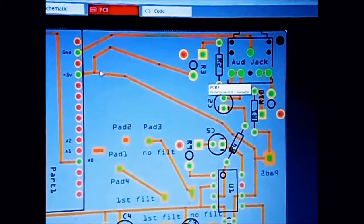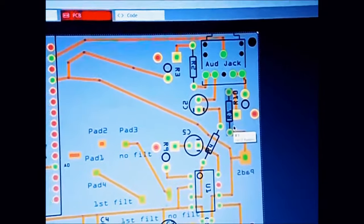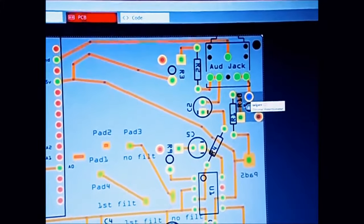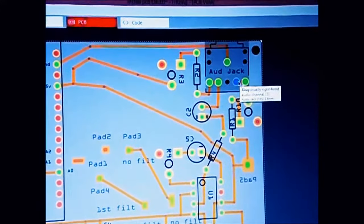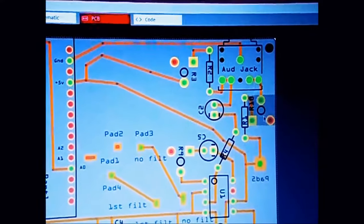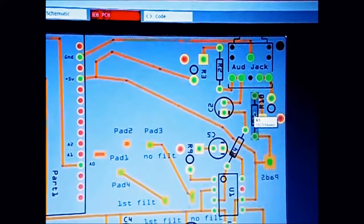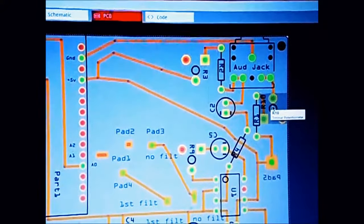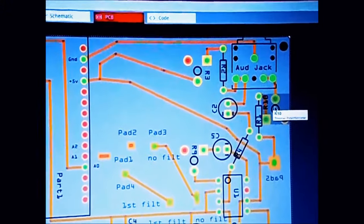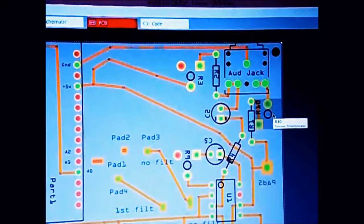So we go now on 5 volts again, goes here under this resistor, and it goes back onto a 150 ohm resistor, and it goes on a 1k pot, and it goes right into your jack, and that powers your LED. When you turn the pot to minimum, only 150 ohms stays, and that's full power. When you turn this to maximum, then your LED will be really weak, and that's what you want: to set it up to really weak when you start getting your signal, and then gradually increase it. It's very important, because you will not get signal and you will be disappointed.